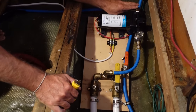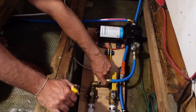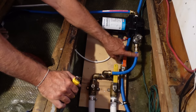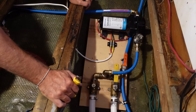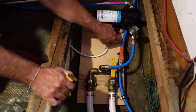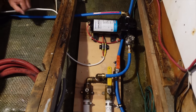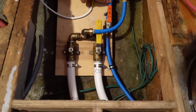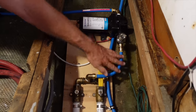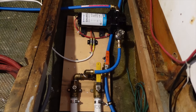I love these fittings — I've never used them before. I think they're called SharkBite fittings, like your Home Depot household fittings. We're only under pressure from a water pump so that should be fine, and they're really easy to work with and bend. They call it PEX — it's all half-inch PEX through pretty much the whole water system. There's a little strainer to strain any debris out from the holding tank. I feel like we're getting somewhere.